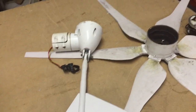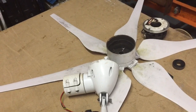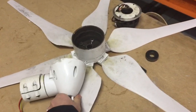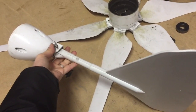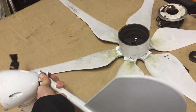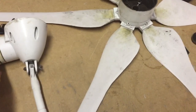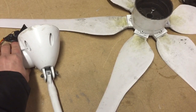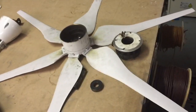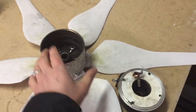After those we got a different turbine and changed the bearings to two new, good quality bearings. This one, when the wind is too high, bends the tail against the wind to slow itself down. I thought that was going to be the winner and resolve the issue of working in high winds. But we opened it up after about three weeks of stormy weather and it had stopped — we could hear a rustling noise coming from it.